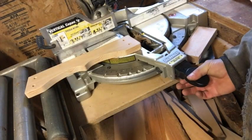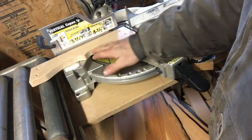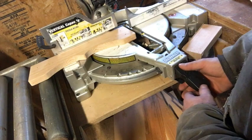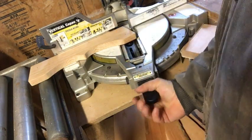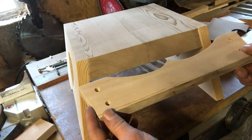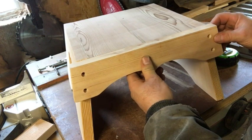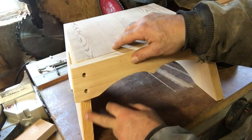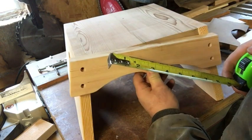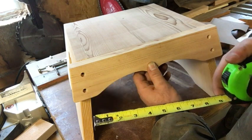The miter saw also has a 10-degree cut on the side. Set the miter saw to the 10-degree mark - the handle has a little trigger that pulls up - lock it in place and make your cut. You can flip it over and do the cut on the same side, or move the miter over to the other 10-degree position and cut the other side. When I have this dimensionally cut - top at 10 degrees, beveled off at 10 degrees so it fits - everything flows the same. It's a 10-degree cut on the leg, 10-degree cut here, 10-degree cut here, so it's flat.